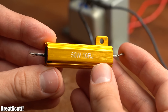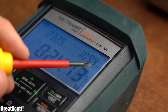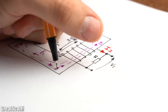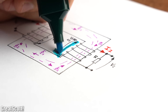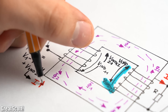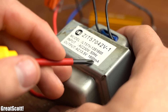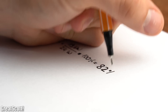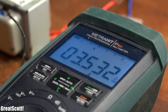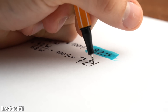With that, let's hook up this 10 Ohm resistor to the secondary coil. The load draws around 1.4A at 14V at the output, while the input current increased to 110mA. The secondary current now also creates a magnetic flux, which not only induces a voltage into its own coil — lowering the output voltage — but also into the primary coil, which increases its overall voltage and lets more current flow on the primary side. The secondary current of 1.4A is still within the transformer's limits, and this transformation came with an efficiency of around 82%. However, adding a 3.3 Ohm resistor to the output shows that the output current exceeds the transformer's limits, the output voltage dropped considerably, and efficiency fell to 72%.